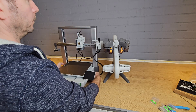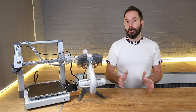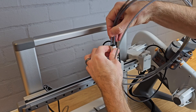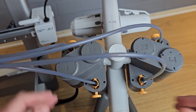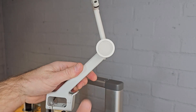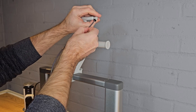With the AMS Lite assembled, sit it on the right-hand side of your printer and find the four clear tubes that connect the AMS to the printhead. There are two different lengths of tubes — the shorter ones attach to ports 1 and 2 on the AMS Lite and the longer ones go to ports 3 and 4. The tubes simply push into the four connectors on the top of the tool head and then into the receptacles on the AMS. All that's left to do is plug the AMS cable into the corresponding socket on the printer base. If you don't have the AMS Lite, assemble and attach the included spool holder to the top of the frame and connect the included filament tube to any one of the four connectors on the top of the hotend and the spool holder connector.